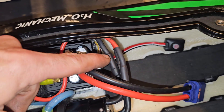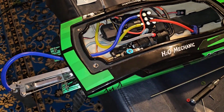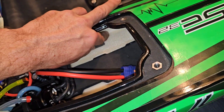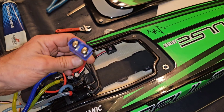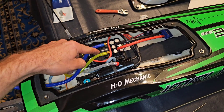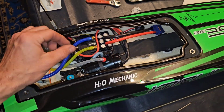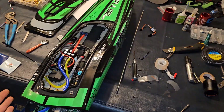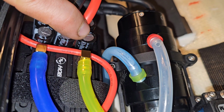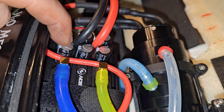We've got all of our wires ran. We've got them coming over here to the 5.5 bullets — these are eight mil bullets. We use number 10 castle wire. I just kind of left my cooling lines long so that when I change this around in the future, I won't have to shorten them and ruin them. All I've got to do is throw some double sided tape on this button. And I've got a series connector to where we can jump two 3S packs, because this is a minimum of a 5S ESC. I wish they would have made it a 4S to 12S ESC — I think that would be ideal. But I do know that these capacitors say 63 volts on them, and the microfarads are 680. So although they are big, they don't have a lot because of the voltage capacity.